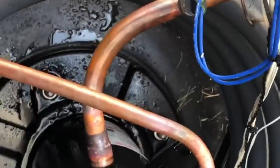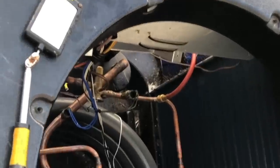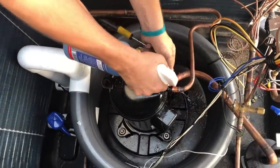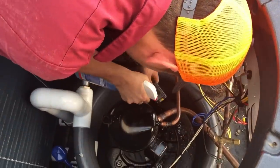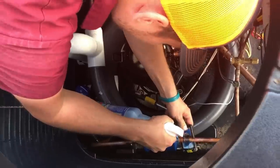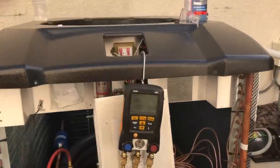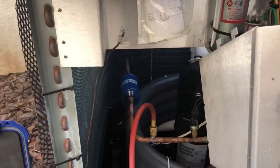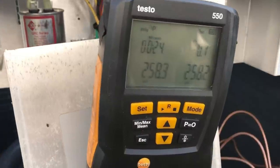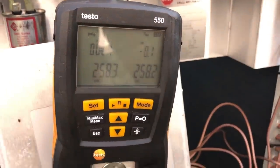All brazed up. We've got it under pressure right now. Going to go around with a mirror and some bubble solution to test all of our joints and confirm there are no visual leaks. We tested with bubbles and then held it on pressure for about 24 minutes at 258 psi — we lost about 0.1 psi, which is pretty good in my book.